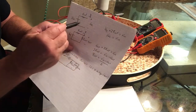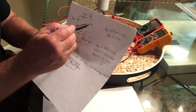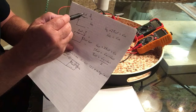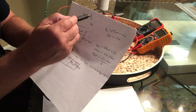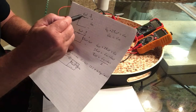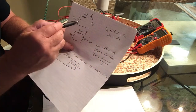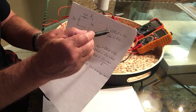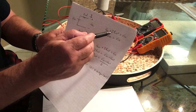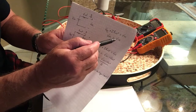So the equation of this circuit is V open circuit plus Ohm's law, which is I times R internal, which is the voltage drop across this internal resistance, is going to be equal to the voltage in. Now I is equal to 0 because it is an open circuit, so this drops out. So it just means that voltage open circuit is equal to voltage in.